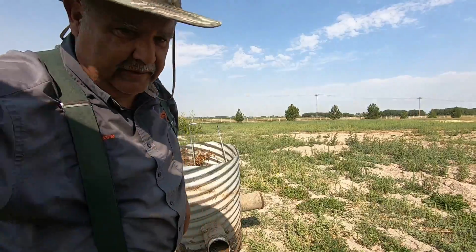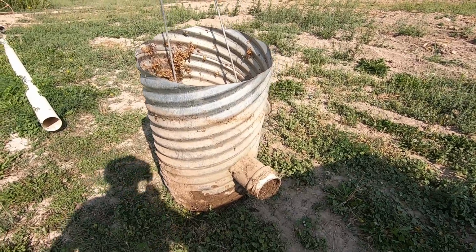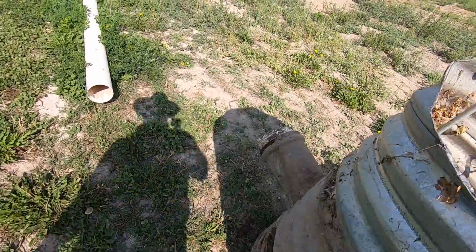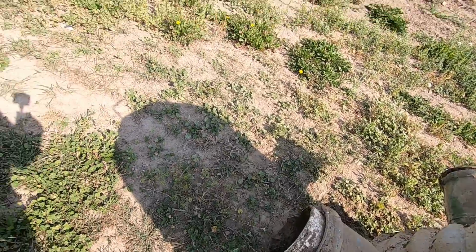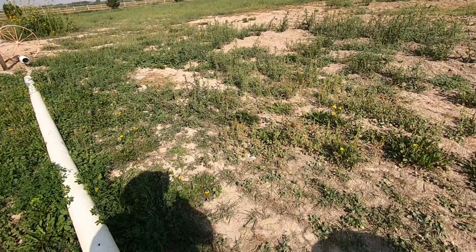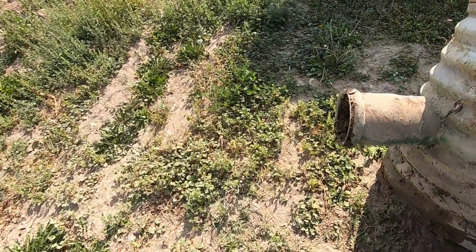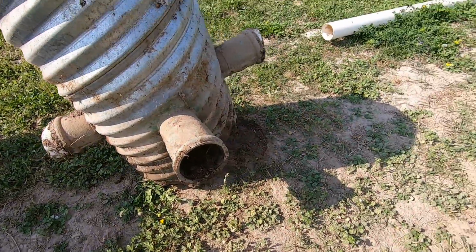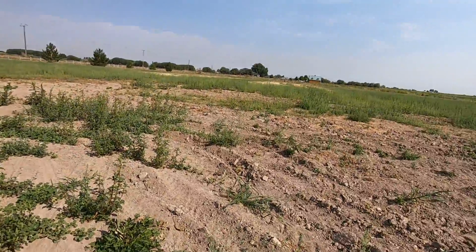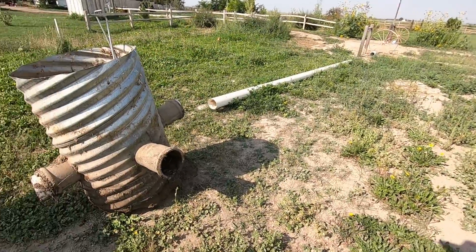Alrighty, there is pretty much where that riser is going to go, and in the orientation where it's going to go. This will be the feed pipe coming in. This one will be the gated pipe running over to the driveway, and we'll put gated pipe in there so we can run water to the north out that way. And then this lug over here, or adapter, that's full of mud, we will throw in more gated pipe to run from here north, and we will be able to water from this line to the west. It's just giving us a bunch of options.